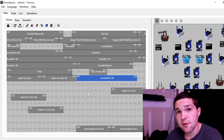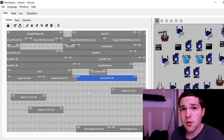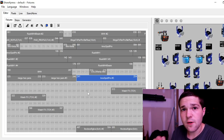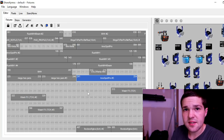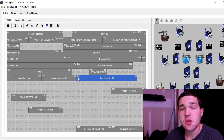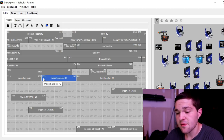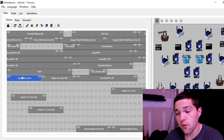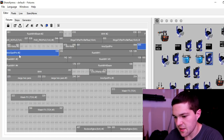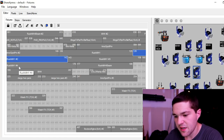We just patched in the third ADJ InnoSpot Pro not too long ago. The number that you're going to set your light to is the corresponding first number in its DMX channel sequence. So for the InnoSpot Pro that we just patched in, it'll be 241. For my Mega Hex PARs, I have channel 233 for one of them and 225 for another one.